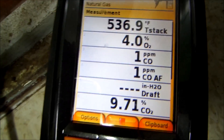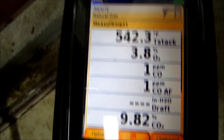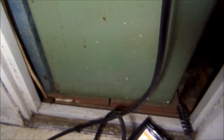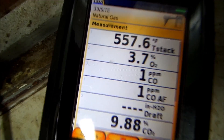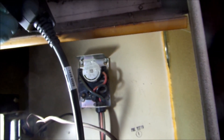Let's check to see if it's got flow now. It's not bad — this thing's running pretty decent considering. Did he change the filter? No. I'd have to get up there and check but this seal's looking good. Wait — I feel something, it just kicked in. Let me check this other seal. This duct isn't cut right either — it ain't gonna blow you into next week, but as long as you can feel it, that's how it's supposed to be.